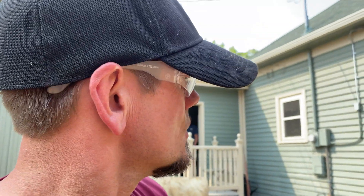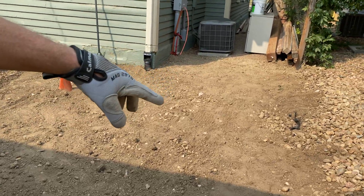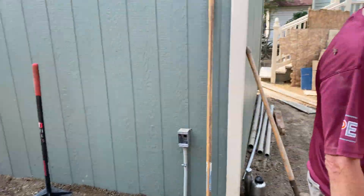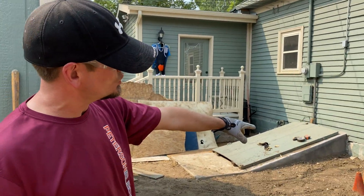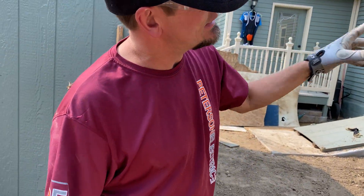The footer for the slab — it's going to be on slab. So we had to fill in here with the irrigation pipe, pulled out a wood stump here. We also had another pylon sitting here that was for a deck that we had to pull out. But we had to dig all this out so they could connect the sewer. We thought we were going to go in there but couldn't, so we had to take all this dirt that was sitting here, put it in, dig it out again to put the service, get it inspected, and put it out. The original building is going to be on Cleveland, and the new building is going to be on South 12th Street. So we had to have an inspection from Loveland Utilities for our power coming in, because we had to put it in with the conduit.